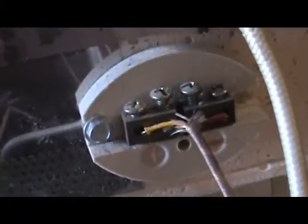So there we go: two bolts, four plugs, all tight, no wires out of place anywhere else. In fact here I'm just going to check some of these just to make sure that these are all in - I'm just pushing to make sure. Get these out of the way, make sure that the thermocouple wire didn't come undone in your frustrations. All the wires are in tight. So now I'm going to reattach the control panel - there are my four holes - and see if it works.